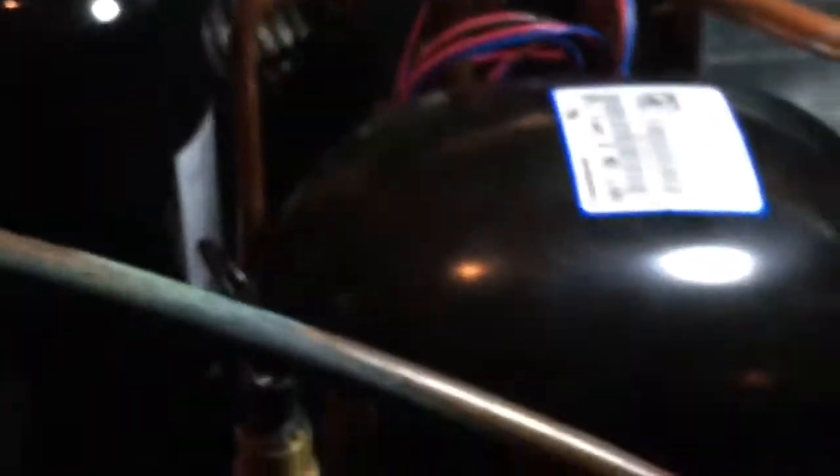So I'm putting in this new unit — we're putting in a M2FM0075-CFV-020. I'll try to zoom in a little bit. R134A. It's three-quarter horse — that's what 0075 means. We're gonna have over 6,000 BTUs, plus 20 suction on this baby.